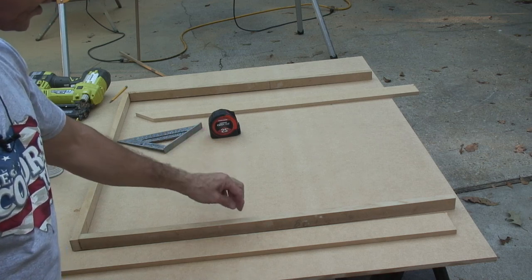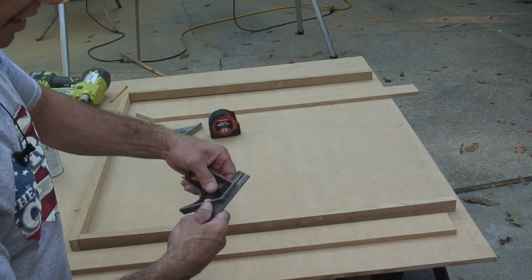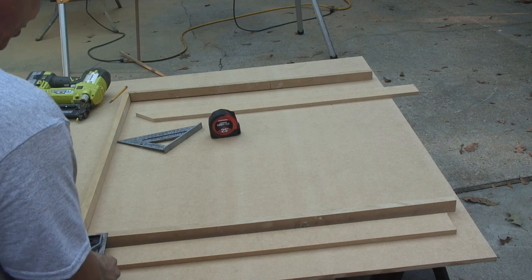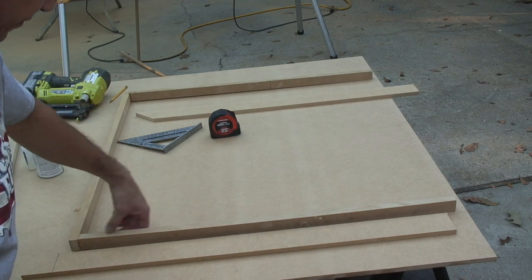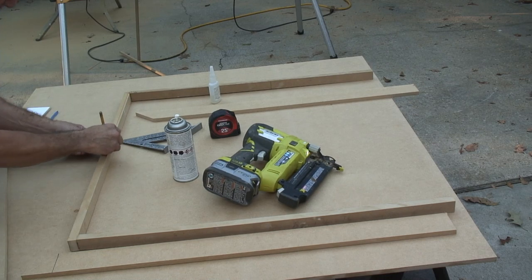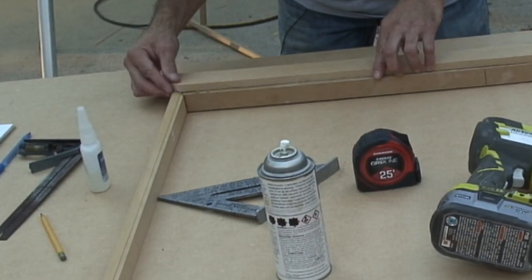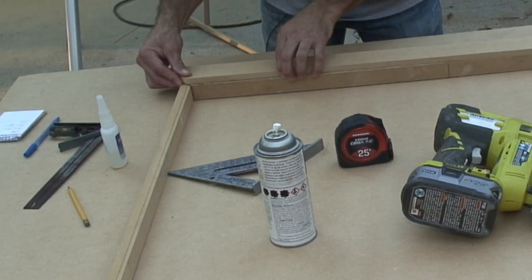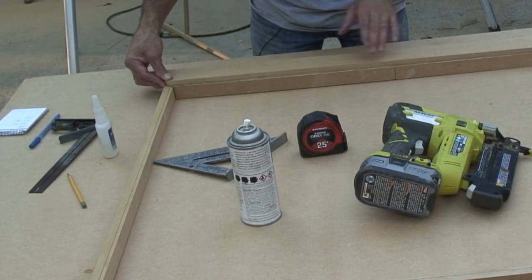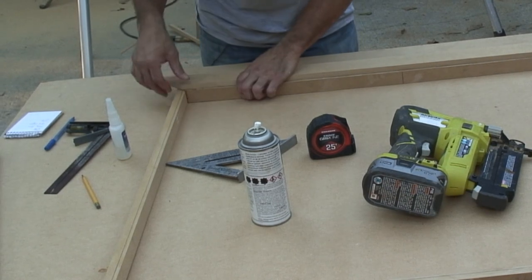I'm going to use my adjustable square. This is three-quarters of an inch wide — I'll go on the inside and mark my line, or if riding along the outside I'll go half inch, so half plus a quarter equals three-quarters. I run my line all the way across to give myself a quarter-inch reveal on the inside. I set it right on that line, and this board that was curled up earlier — you just pull it back as you go. You don't shoot nails here and there; you shoot it and walk that line down. No big deal — easy fix.